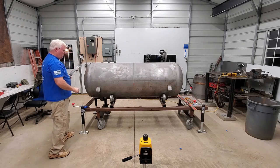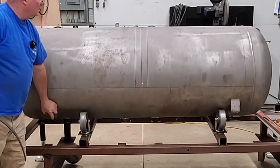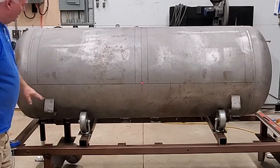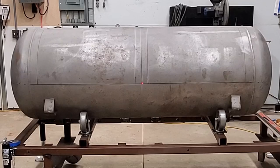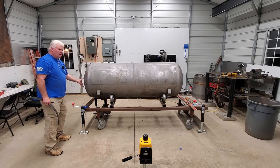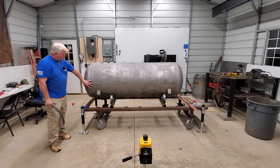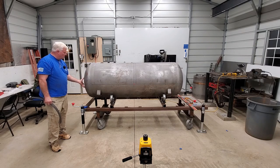And there's our two doors. I kind of like that setup. Our bung holes are way back out of the way — they'll be patched, repaired, sanded and ground. Any evidence of those is going to be underneath our table. I think that's going to work good. Collector's going to go here — we'll use this line that wraps around, joined to the one in the back. That'll be the center line of our collector. In this case I'm going to run the collector center on grate line. Running it an inch or so down or up just complicates things. Your bottom plates are exactly the same when you run it in the center, whereas if you run it higher you've got two different shapes of plate. It is so much easier to run that exhaust collector right in the center.